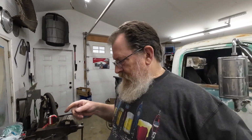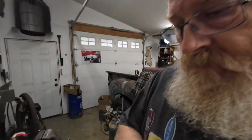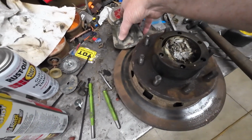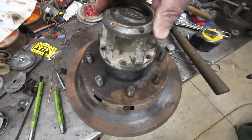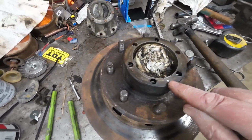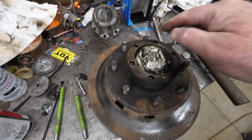All right, so it's been 24 hours or so, but they soaked and they're still not coming out. But I had a thought. What about, instead of trying to helicoil these holes so it fits, why don't I just clock it like that, drill new holes and retap them? That way they won't be walked out like that.